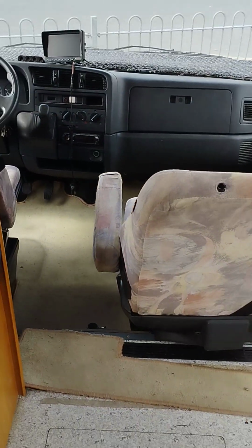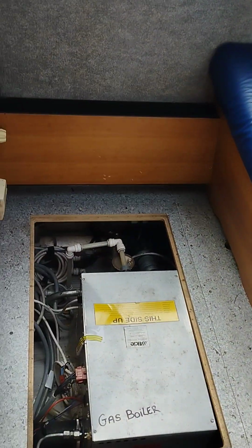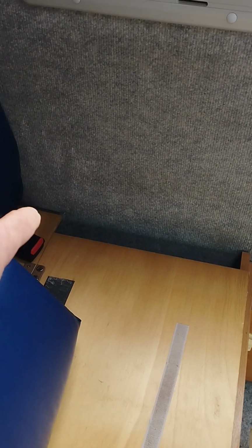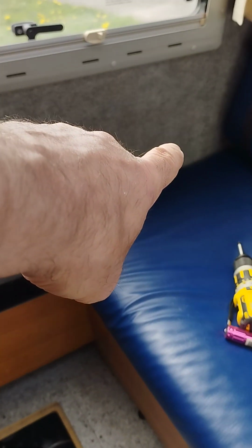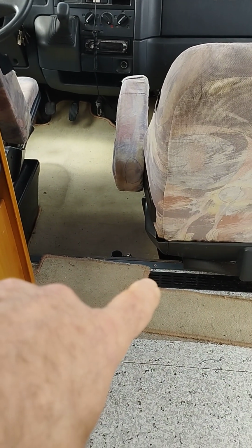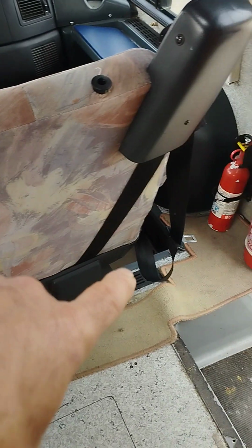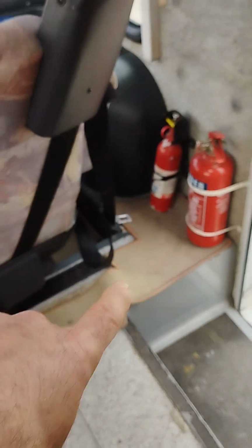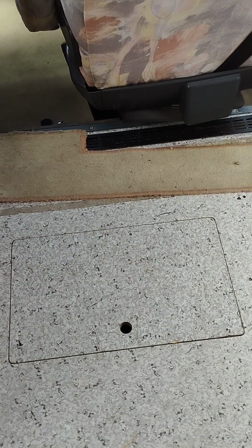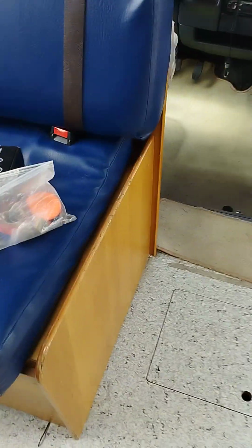And then I'm going to move backwards so you can see. That was our first bleed point on top of that canister. We had one in behind this chair over here, and one in behind that chair over there. Towards the front of the van we had one under that vent. Towards where I have my fire extinguishers, we had another bleed point there, and also in under that panel there we had another one. They are all low bleeding points.